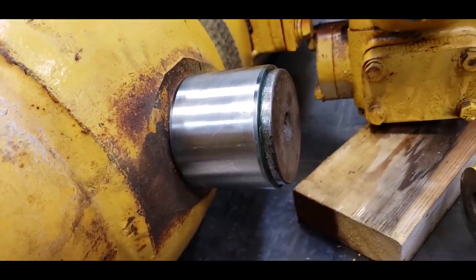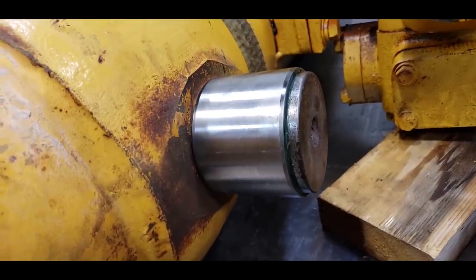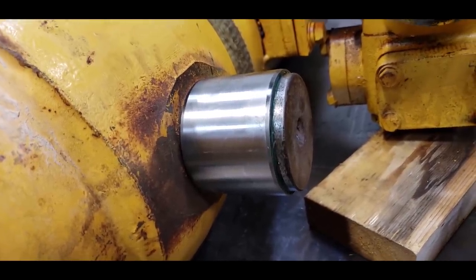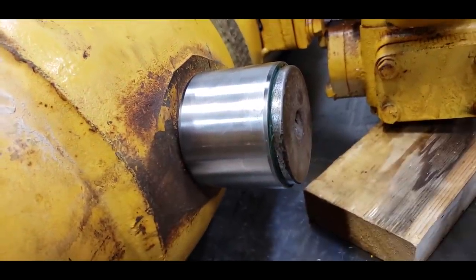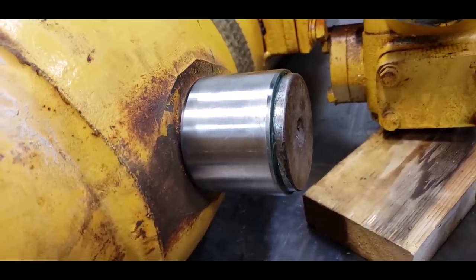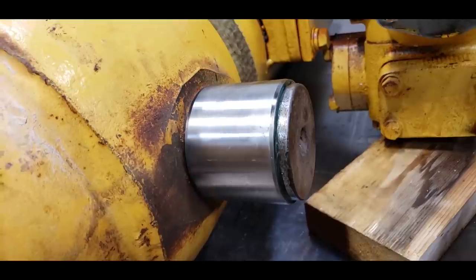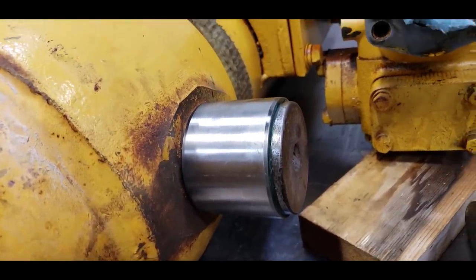But Cat bearing mount, well, it's not Cat anymore. It's Loctite. It was always Loctite. But that bearing mount is wicked stuff. And if you put the primer on with it, and it's something that fits fairly tight, you better get it on and get it on now, because it will set up instant. You don't get much time once you put the primer on it.